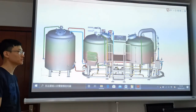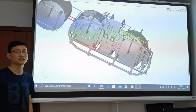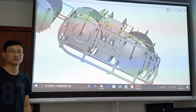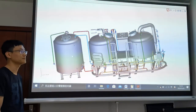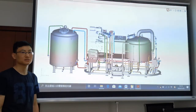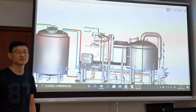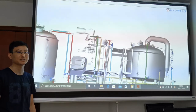On the bottom, there are two circle rims — one is used for collecting the wort, and the second is used for CIP to flush the false bottom. There is one rinsing system for sparging and spent grain removal: one sparging arm for sparging, two rinse arms for lauter rinsing, and two CIP spray balls to clean the tank.